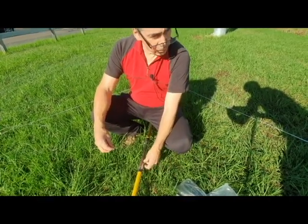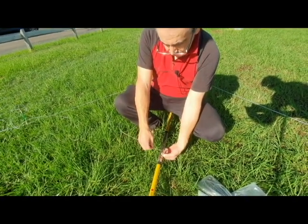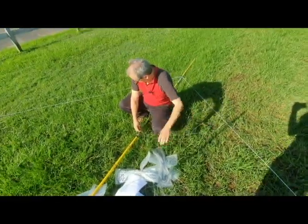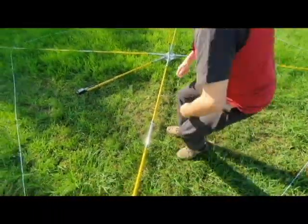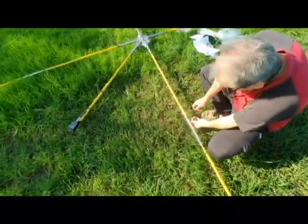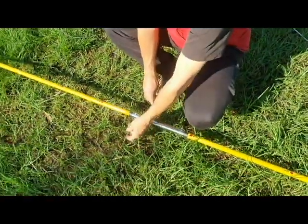We're back now — we've got to feed this through two elements; that's the 21-meter. Feed it through the hole like so, and again through this one. Feed it through this hole — you got that, Chris? That's it for that side, and this one goes to the balun.